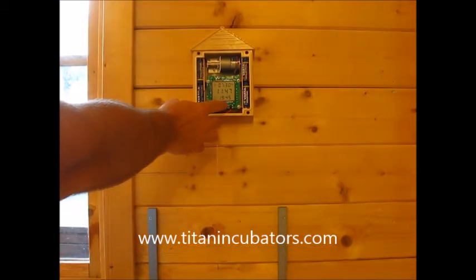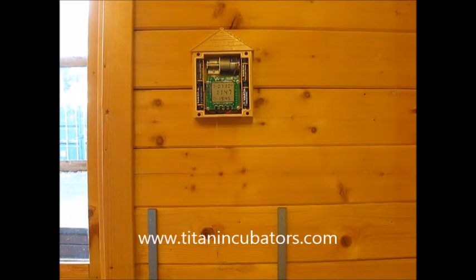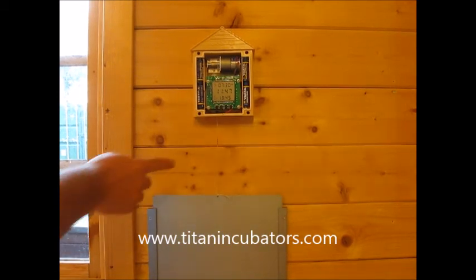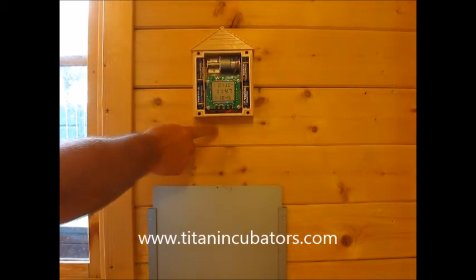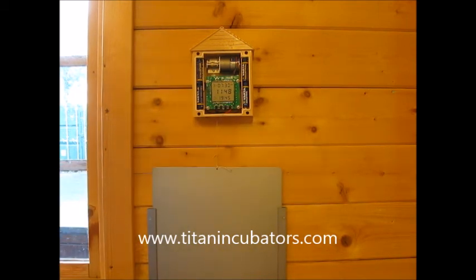Now I'm going to press and hold the plus button for 3 seconds. And as you can see, the door starts to come up. So now I'm just testing that the door goes up, and obviously it's working absolutely fine. As you can see, as the door is going up in our test, there is a red knot here. This red knot must go through the base hole, and it will go up, it will knock the top limit switch, telling the unit that the door is open.